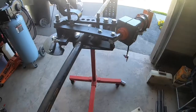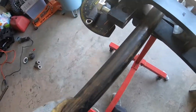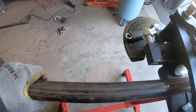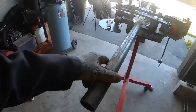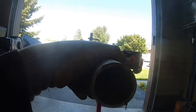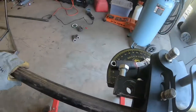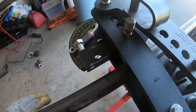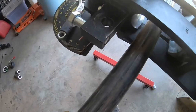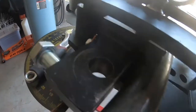I'll show you how I'm doing this. I took my first measurement at 574 and marked on top of the weld line because this is HREW tubing — it has a weld seam. DOM tubing is made by drawing HREW through a mandrel, making it stronger and eliminating the weld seam, but it's more expensive. This will work fine for our purposes.